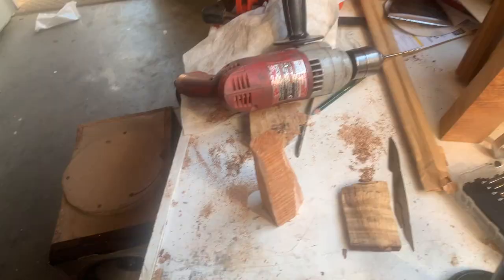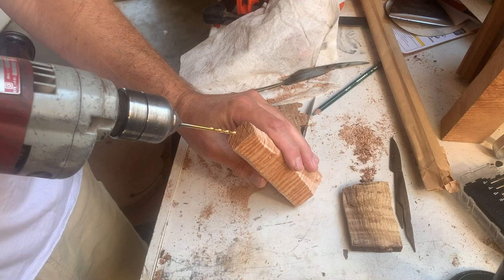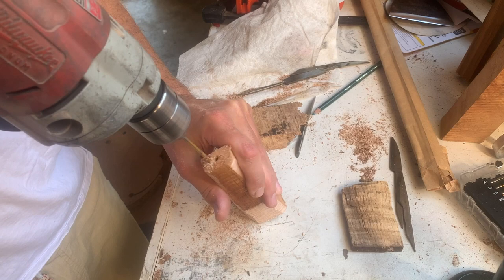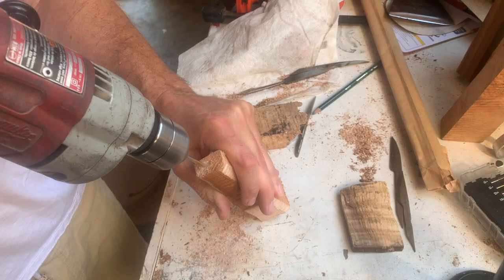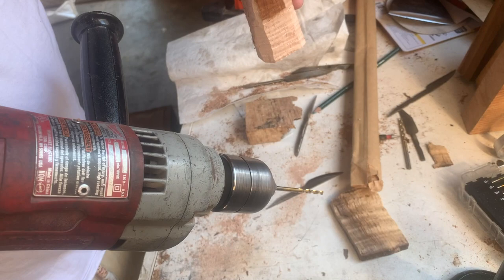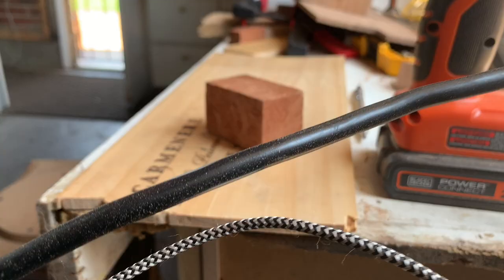We're going to do some shoulder pieces to cover up how ugly this first hole is. For your first knives, you don't have to worry about what these look like. Fill it up with some epoxy and it's going to be totally fine — it's going to be a quality knife. After you make these yourself, you'll look at store-bought knives and realize they just drilled a hole, stuck a tang in, and put a bunch of epoxy. You can mix the epoxy with some sawdust — save your sawdust — and it won't show up as much.